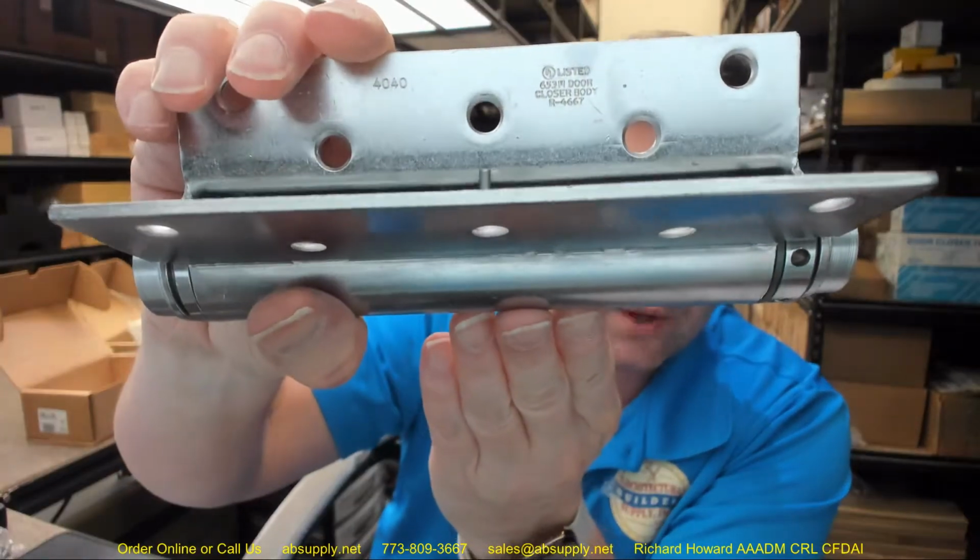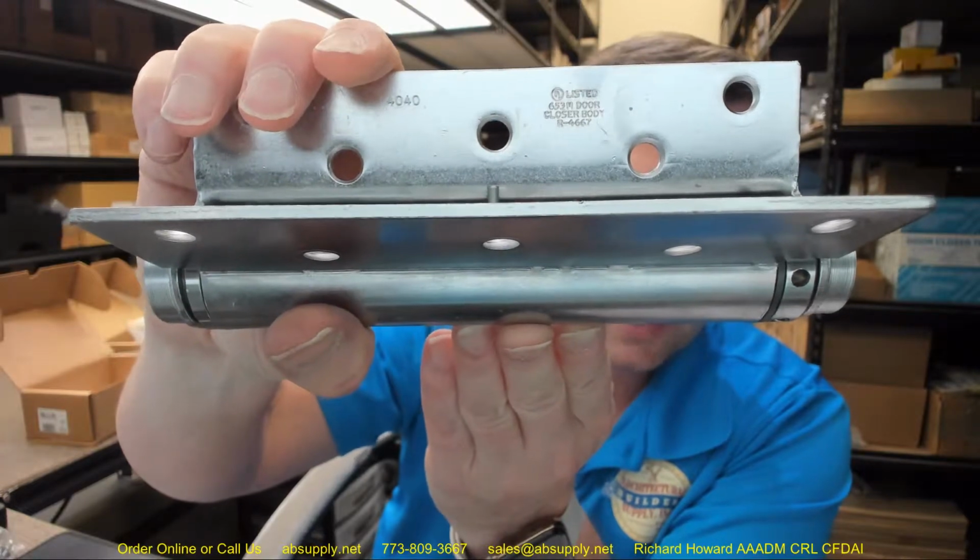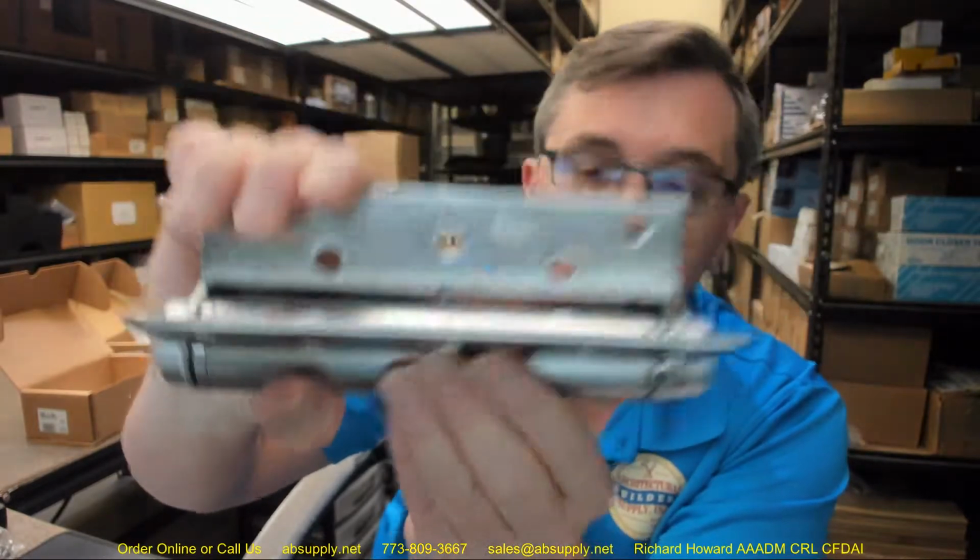It is not adequate on a fire-rated door when you are using spring hinges to have just any spring hinge. The criteria that must be met is if you are closing a fire-rated door with a spring hinge, the door must be self-closing and self-latching, the two cardinal rules of fire-rated doors. But when it's a spring hinge, it must be labeled.